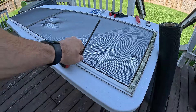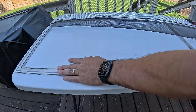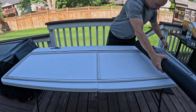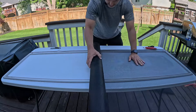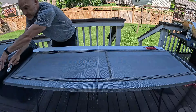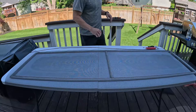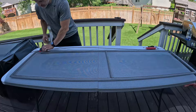Let's get all this out and then I'll show you how to put the screen back in. Take your roll and just place the edge right over the frame and roll it out. Give it maybe an inch or so on the top and sides so you can pull it tight — you'll cut off the excess. Get this lined up, and this is where clamps come in handy, especially if you're doing this outside where the wind is blowing. Just clamp it in place and maybe get another clamp on the other side too, pulling it a little tight.